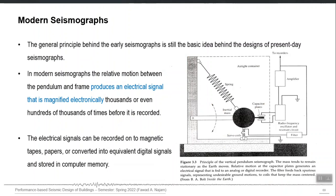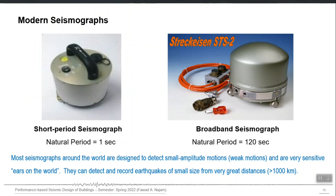This is John Milne's original device. Modern seismographs are still based on the same pendulum idea, but now with smart materials — by controlling the electrical signal in them, we can control their stiffnesses and therefore their time periods. We can develop a 100-second time period pendulum within a very small assembly of a few centimeters. Modern seismographs can be classified based on their own natural time periods. For example, a short period seismograph may have a natural time period of one second. If the ground shaking itself has a time period of one second, this seismograph cannot record it.